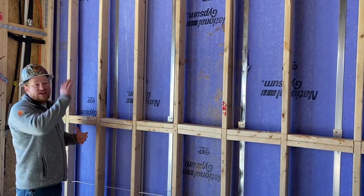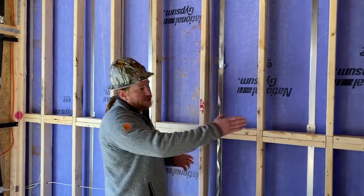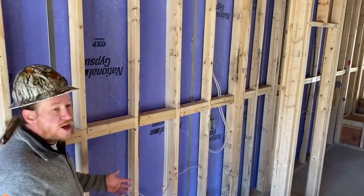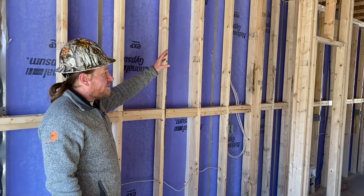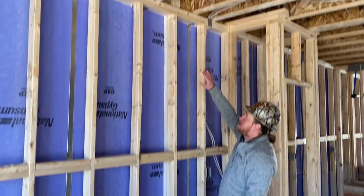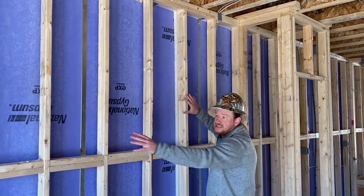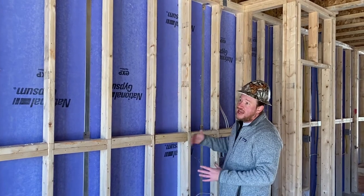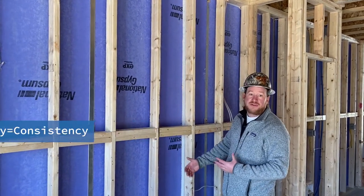This is a two-story unit so we would have done that on the top as well. Some redundancy is okay when we're talking about air sealing. Another example would be these spacers — every eight feet fire code is going to make you put these spacers in, but they also serve a purpose for compartmentalization of air leakage. If the air seal is damaged or imperfect in one area it can't affect the whole wall as easily. We want to air seal both sides of this gap as well, so that if we have a problem here it's contained to an eight-foot section rather than running the whole 40-foot length of the party wall. There are several redundant layers of air sealing here to consistently achieve our goals at the blower door test at finals.